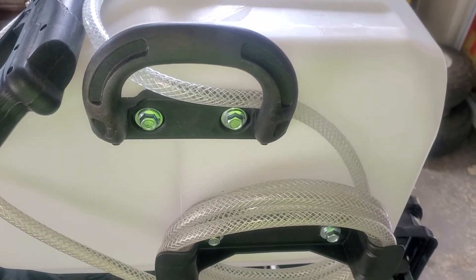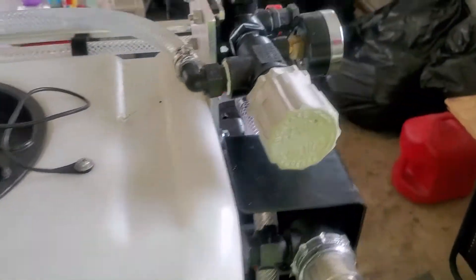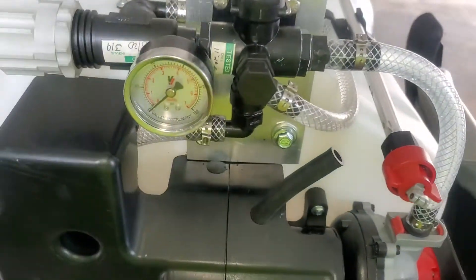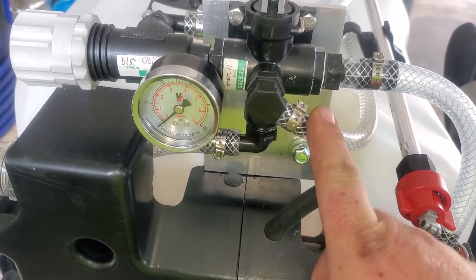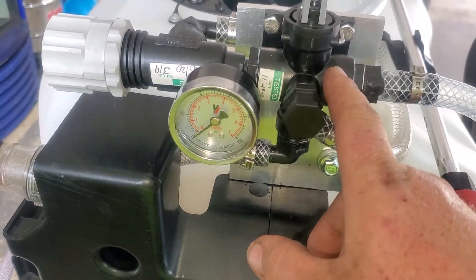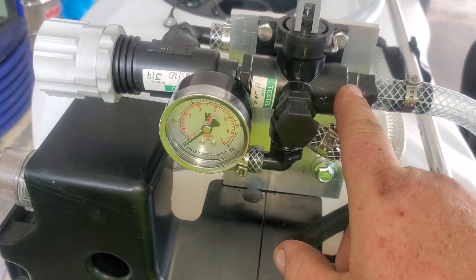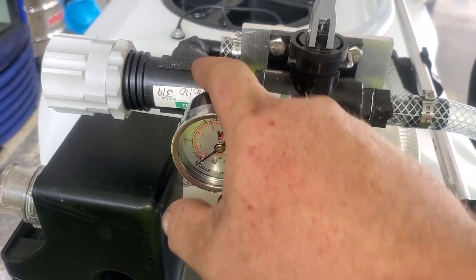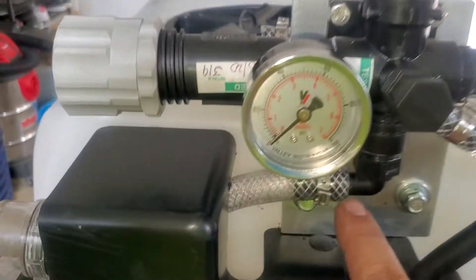When you're only using a boom, you really only need one manual valve because you can tap off the sprayer right off here — it comes with a quarter-inch hole. This fitting is three-quarter inch, and I used bushings on both sides to step it down to half inch. This is a half-inch T-jet bypass valve with a half-inch inlet.